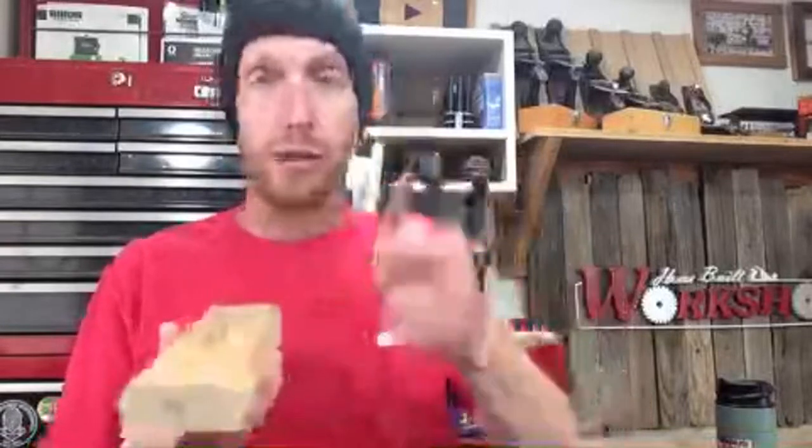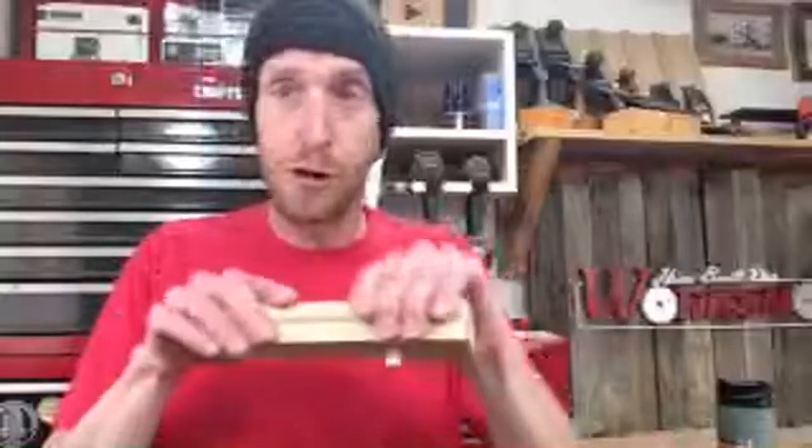So there are ways that you can get around that, and some people will build guides, a channel where this can't move, and then you put your neck in it, and then there's just like some little rails. You could use like 1/4-inch stock or something, just to keep this thing perfectly straight, which is actually a really good idea, and probably something that I'll look at doing, because that would take a little bit of the struggle out of sanding the radius in there, because you have to go really careful to not sand too far on one side or the other. But that's what I use.